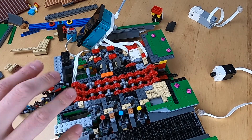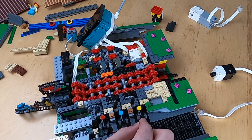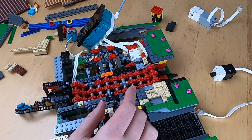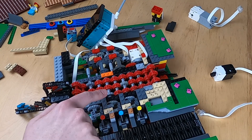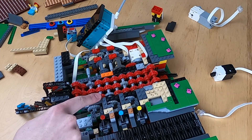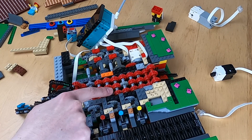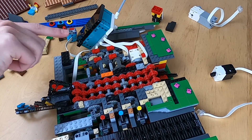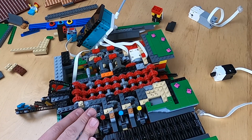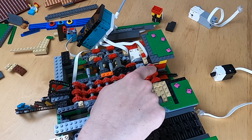I showed you the trigger mechanism — just pushing the tracks like this. In the middle I have a lot of red gears. The red gears can roll on the axis without interacting with it — they have no resistance. The gray gears do interact: when you turn the axis, the gray gear is activated. So this is for the cyan horse, that's the first one. Then we have the yellow in the middle, and lastly the red one over here. That is for pushing the three horses. I have gears all the way through to pull from four gears at the same time, minimizing slippage and keeping the function reliable.